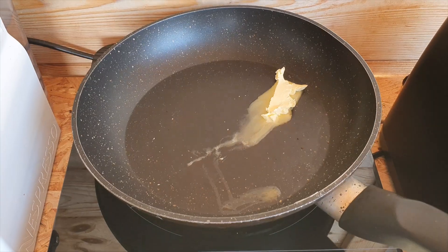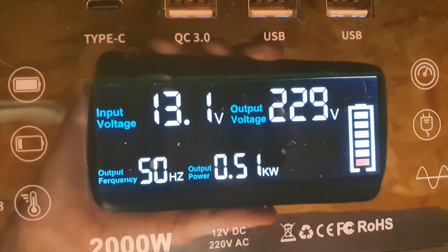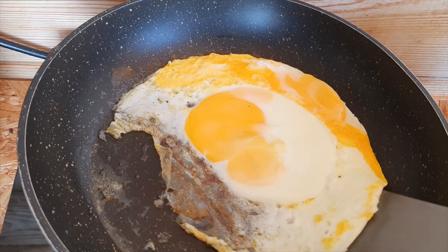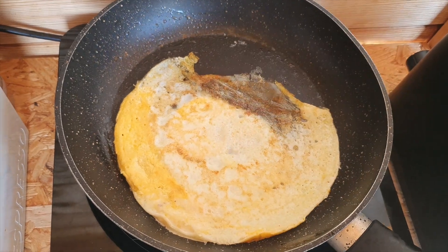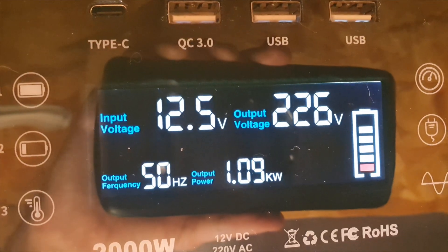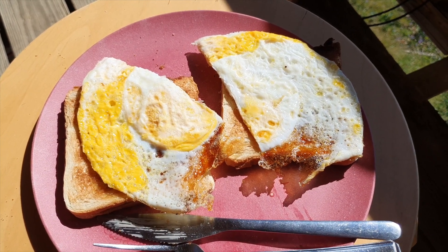For my next test I decided to use a bit more wattage, so I cooked a couple of eggs using the induction stove — about 1,100 watts. Just ignore what the induction stove's display shows for wattage; it's a little strange. The induction stove simply cycles on and off depending on which wattage setting you choose. I was reading 94 amps coming out of the battery to the inverter, and then from the inverter to the induction stove I was getting about 1,100 watts. It worked really well — the eggs cooked so quickly I actually had to turn it down.